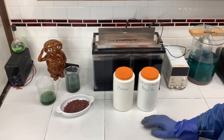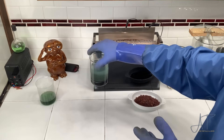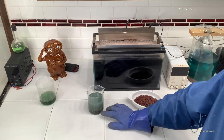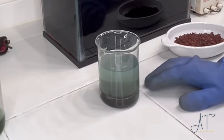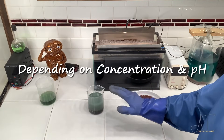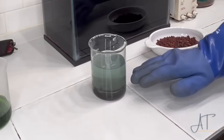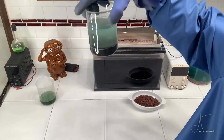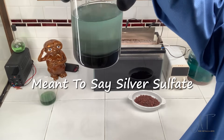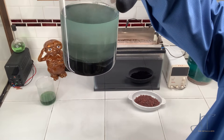One of the reasons why I really do prefer using sulfuric acid in this step is that all of the copper goes into solution — the copper will dissolve into the sulfuric acid, leaving behind silver. There's kind of a white line in here, and this is why I like sulfuric: there's a visual indication. If you stir this and let it settle, the metals will sort out somewhat by density, so you can see if you have contaminants. That black powder should be a combination of silver metal and silver oxide. The white layer is most likely titanium that came off the titanium rack we used to rest our silver plated items on.